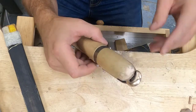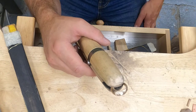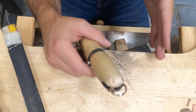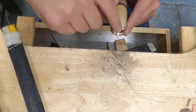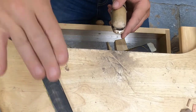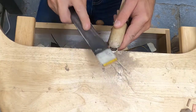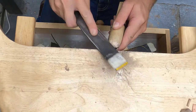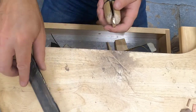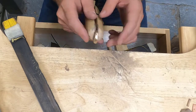I get really frustrated when I see people try to skip steps, or they don't go back and address that scratch and they try to polish it out. Trying to polish it out is going to make it look 100 times worse, because all you're doing is polishing the metal around that scratch. Take a step back, get the more aggressive sandpaper, and do an effective job. Most of the time, the difference between something looking completely finished and something looking completely unfinished is such a small amount of effort. You know, you've gotten it this far, just finish the job.